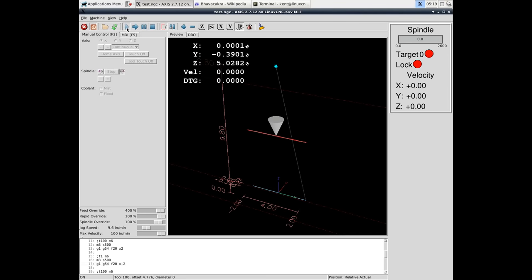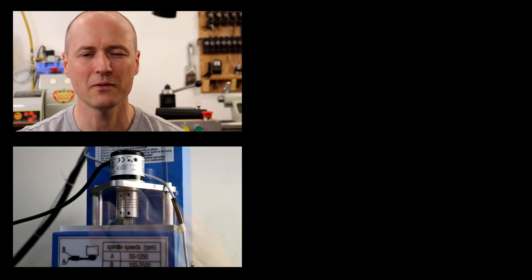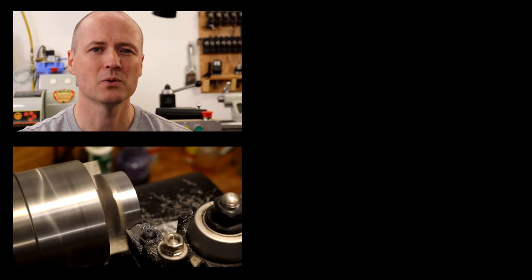Now with the spindle locked, I'll start the program. And there's no motion until I unlock the spindle. I think a spindle lock should be standard on the PM25, but what do you think? The next video I plan to make is a spindle encoder for the PM25 for doing rigid tapping.